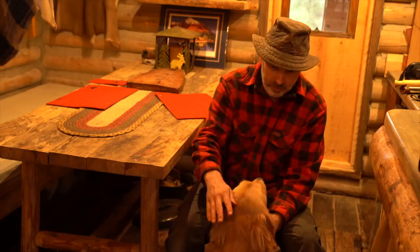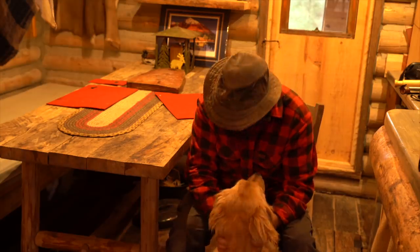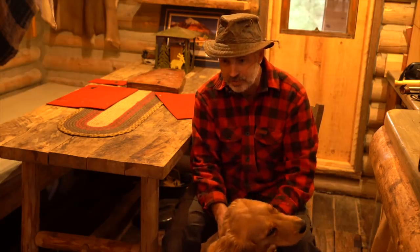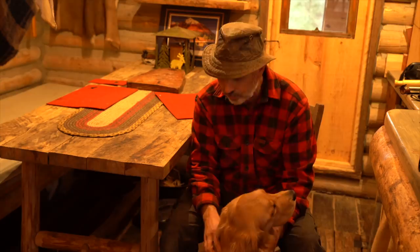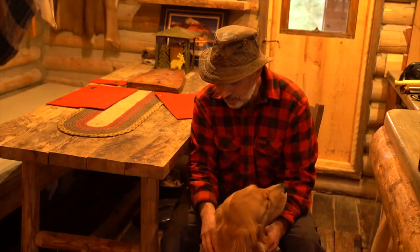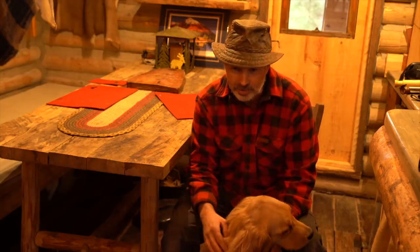The char on the floor is still working well. It still kind of hides the dirt, which just seems to be necessary. But definitely something I wouldn't do again. I'd try to use seasoned boards, ideally tongue and groove, if I can figure out how to make decent tongue and groove without power tools, or even a shiplap of some kind. And then, of course, drying the boards out first if I can would be ideal.